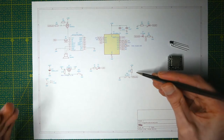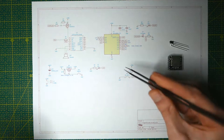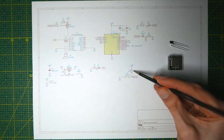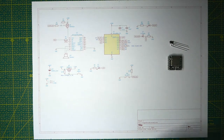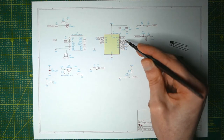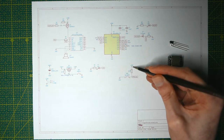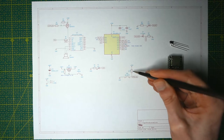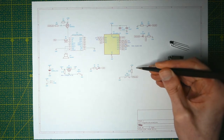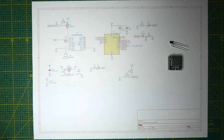Then we have the calibration button. When I built mine I skipped the 10kΩ resistor and just used the built-in pull-up resistor in the microcontroller, because I was running out of space and couldn't find a way to fit the resistor in. An input on the microcontroller is like a capacitor — when it's charged up that registers as a 1, and when discharged that registers as a 0. When the button is not pressed it's connected to 3.8 volts through the resistor which charges up the pin. When pressed, current flows directly to ground. It will draw about half a milliamp when pressed, but since the button will only be pressed for about a second, that doesn't really matter for power draw.